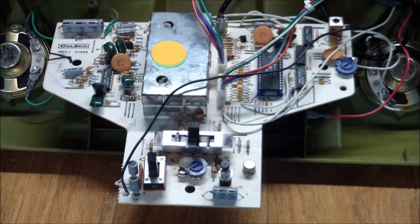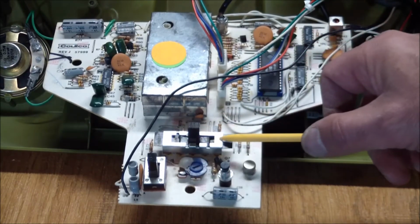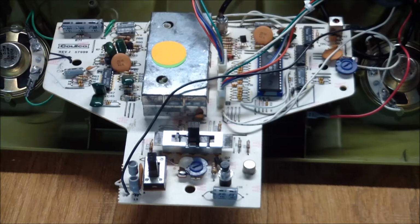Not so fast, Artie. Yeah, I put the whole thing together, and then I realized that these switches were really wonky. This one, just changing between games, you had to play around with it to get it just right to change games properly. And this switch didn't seem to be working. The reset switch. That's a simple, normally open push-button switch, so that one is easy to test.